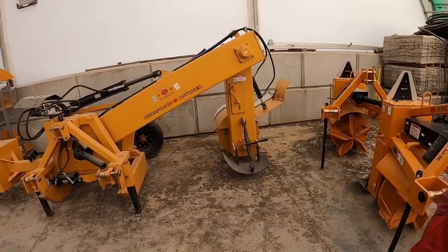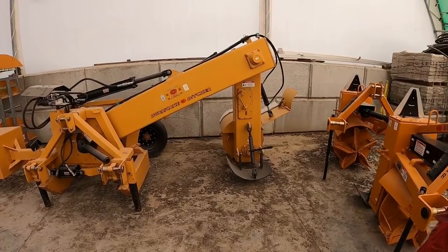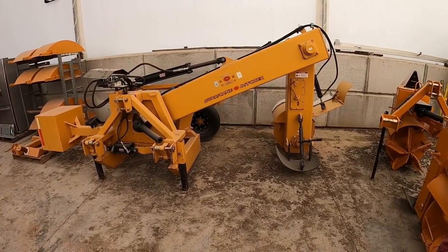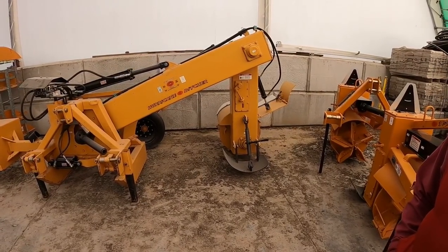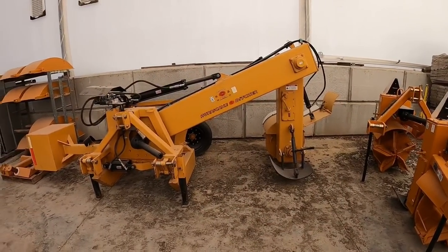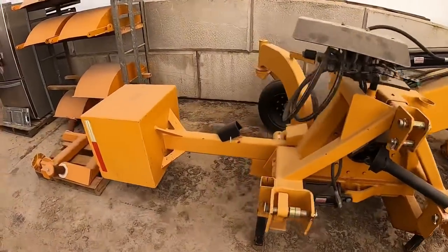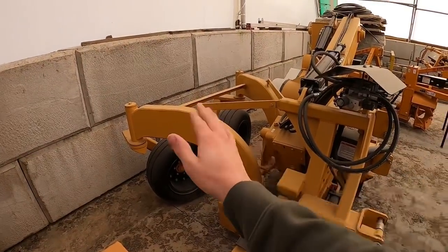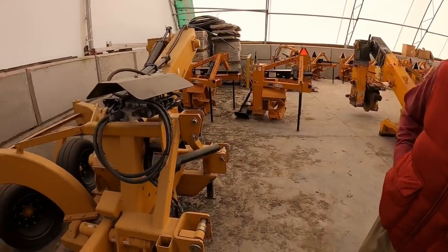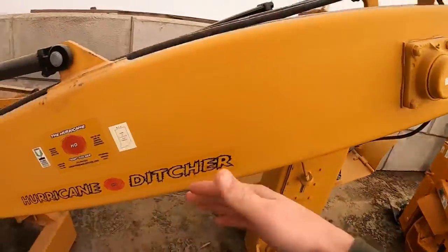Now this one — there's only two of them like it in the world. This is what they call the reversed baby side arm. If you had a tractor with a front hitch and a front PTO, you're actually pushing it rather than pulling it, which is the most efficient way to run one of those ditchers. I've never seen one of these before — I was looking at it going, what's going on here? Is this a prototype? No, it's an actual machine — they've sold this one. These tires up front control how high or low it goes. You've got a lot of weight on the front of a tractor doing this, so you're carrying it on the wheels to help support it. These cylinders move the end of it up, down, out, sideways, and it's obviously PTO driven with chains inside running the impeller.